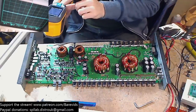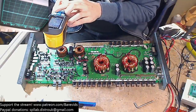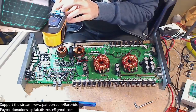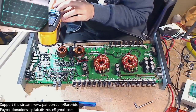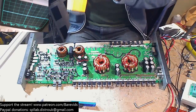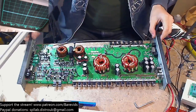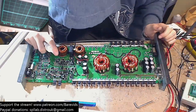I'm going to see whether I can change some settings on here to make it a little bit easier for me to see what it is that's getting hot. I might have to turn to the trusty old alcohol method and spray some alcohol on the board. That's what I'm going to do. This is a little bit too hard to see. I'm going to take some 99% isopropyl alcohol, and I'm going to spray that over this section where things were getting a bit warm,